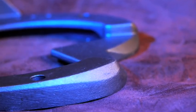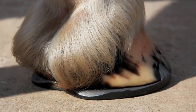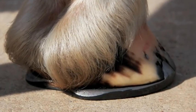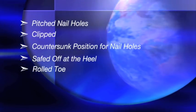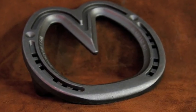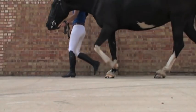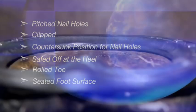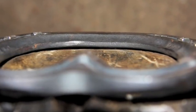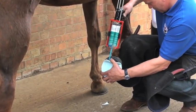Safed off at the heel, saving time whilst providing an excellent fit to the foot. A rolled toe facilitates break over, providing comfort for the horse and allowing ease of movement. A seated foot surface reduces the possibility of sole pressure and provides a cavity to secure soft pack materials.